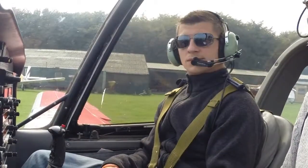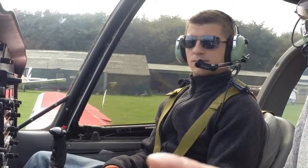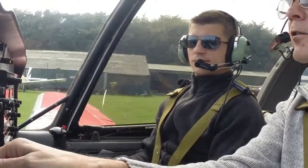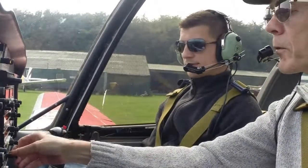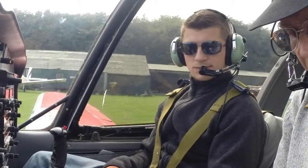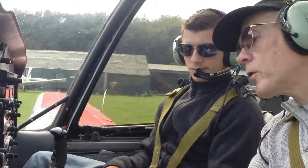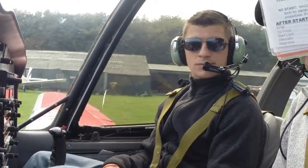I've got a gauge. Yep. Gauge. Lost it there. That tells me what it's actually up to. Instruments, we switched, check that, and that's now showing 7. Transponder is on standby. Parking brake is on, fuel set to both. Oil temperature is good. Mixture fully rich. Throttle, we've wound up to 1800.